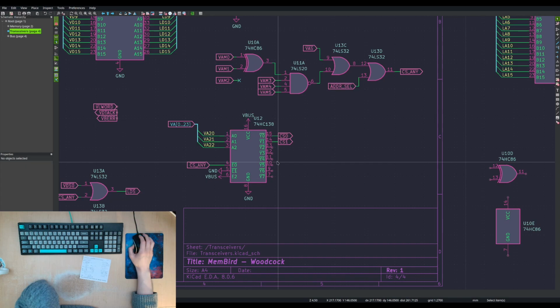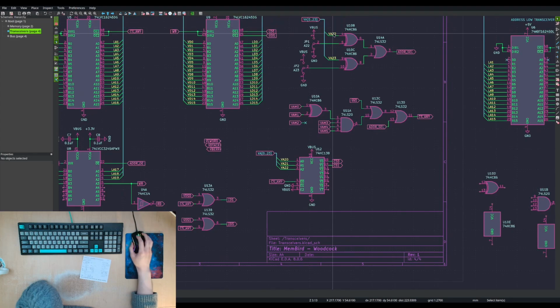I know I only need a 4 output, a 2 to 4. But I'm thinking, like, what if I put this on and you set this to expect, like, no, that just wouldn't work. You just wouldn't have, it would not assert. If you put it in an intermediate address, no, it wouldn't at all. So you'd have to have a way of forcing this high or making this a don't care or something like that.